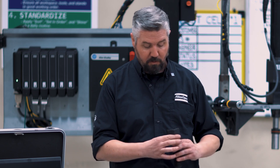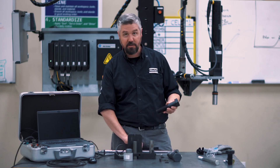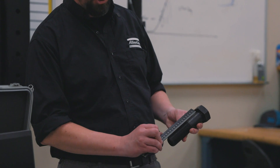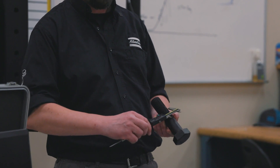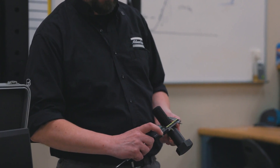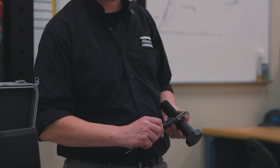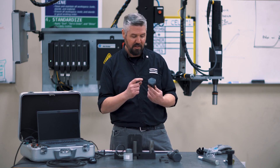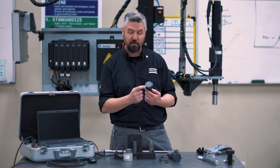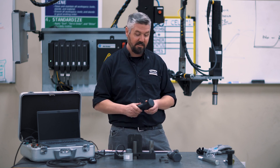For a metric bolt, we've got a 10.9 — a decimal number on here. I'm going to measure under the head in millimeters: 150 millimeters long. Across the threads tells us the size of this bolt. Switching my calipers to a millimeter setting, I measure just under 36 millimeters. This is an M36 fastener that's 150 millimeters long, grade 10.9. That's going to get you right where you need to be in selecting the size of this fastener.